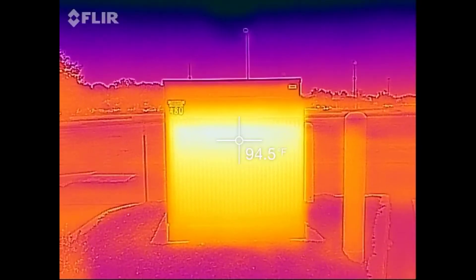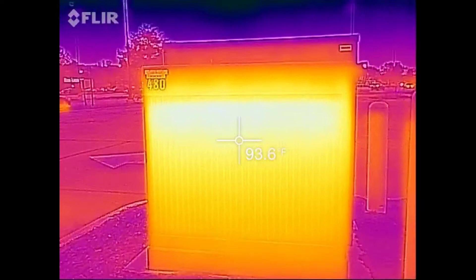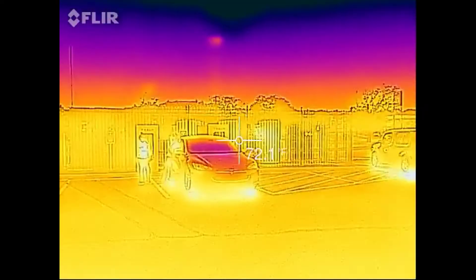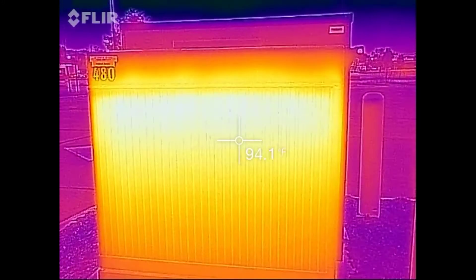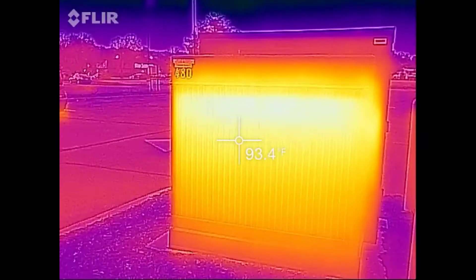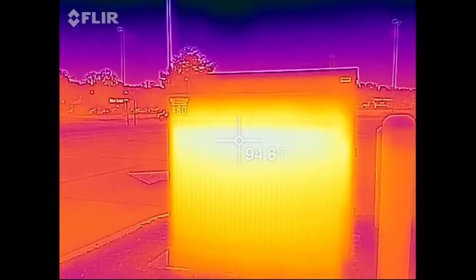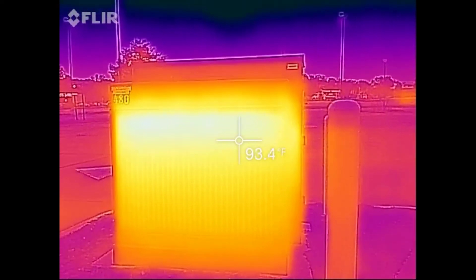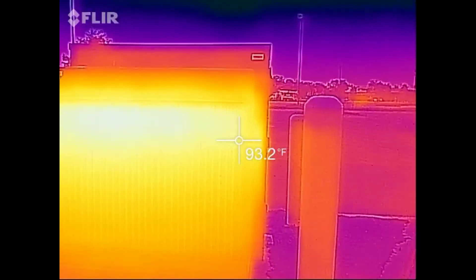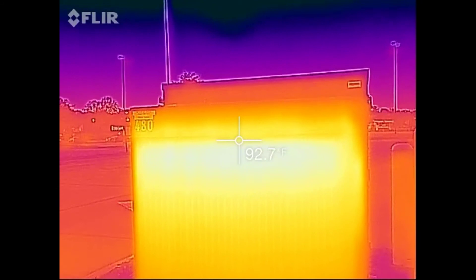Just some thermal fun. This transformer powers only the Tesla supercharger. There's my car supercharging now, and there are three stalls, so that is 360 kilowatts worth of charging capacity for cars. This is a 500 kVA transformer and I'm only drawing about 40 kW right now.